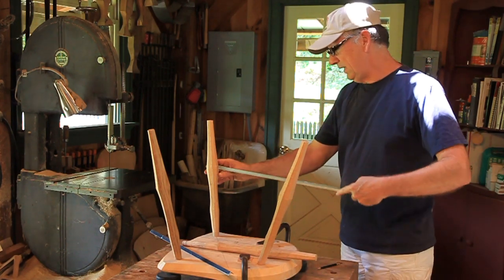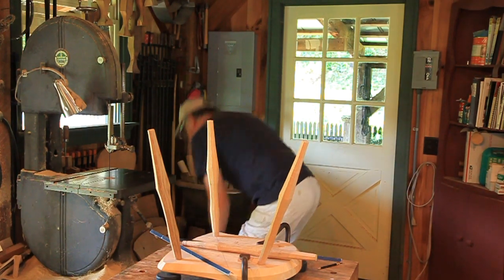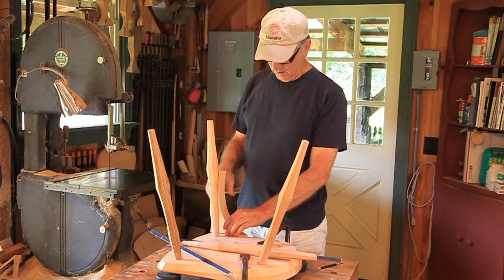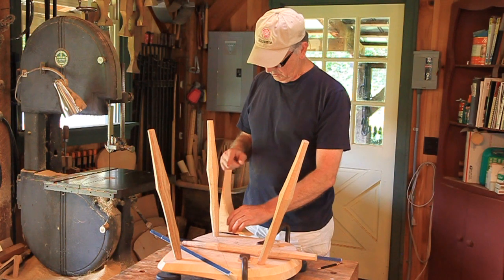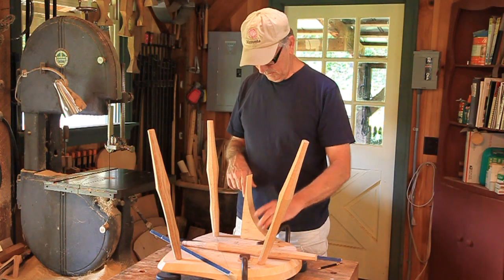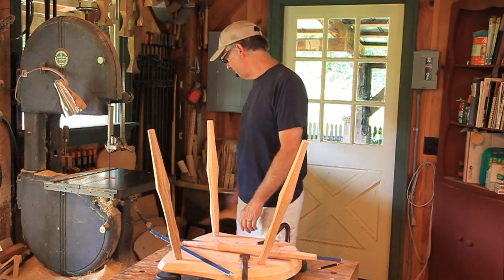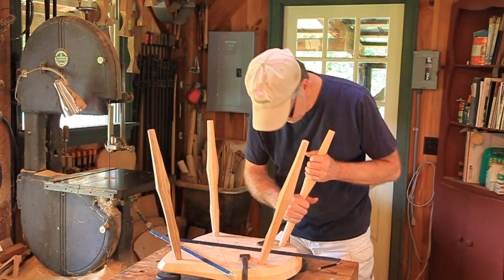For the height angle, what you would do is just get a height. Pick up a scrap of wood — you get the idea — and you just cut it, say the shank of your bit is a quarter inch. Then you would cut it an eighth inch below where that point is, set it right back here, and put the shank of that auger bit right on top of that. And so now you have this angle. It's a great way to do it. I do it like that sometimes, but that's not the way I'm going to do it this time.